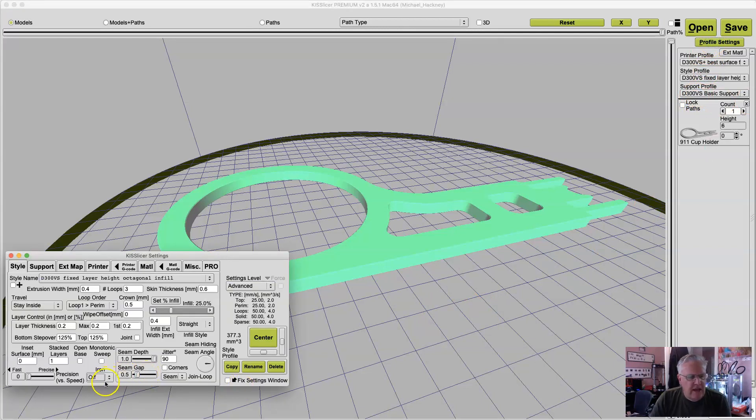Let's go to my profile settings. You'll notice under the Style settings there's now a new drop-down called Iron, with three options: Off, Sweep, and Group. Sweep goes across the entire extent of the part in one continuous motion, even going over large through-openings, back and forth. Group will try to maintain staying over the part that was printed — it avoids going across open expanses. I'll demonstrate slicing both ways so you can see the difference visually. But that's it — just one parameter.